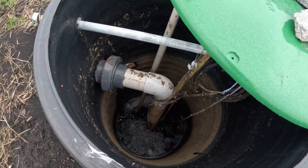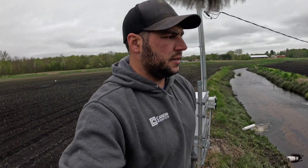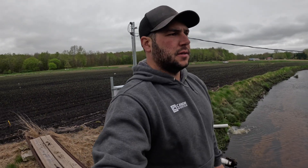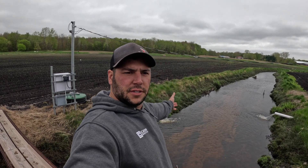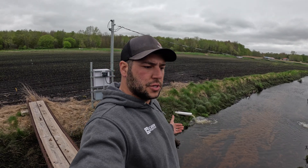Checking out some pumps with our Patney Grosso farm. These lift stations that we put in — this is where they shine. You can see on the ditch banks the water level where that was at. If you were to have outlets in this ditch, water comes up and those outlets aren't going to let water out. These pumps force the water out, so you're constantly keeping the oxygen levels in the soil and keeping the saturation as low as you can. Can't do much about 2.2 inches of rain, but it's better than it could be.